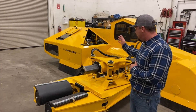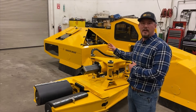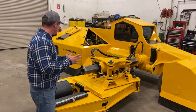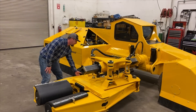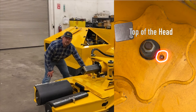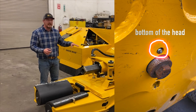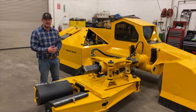One other thing that doesn't get talked about enough — right now we are the only shaking company in the industry that has external greasable bearings. What that means for you is easy serviceability and quick access. Normally you've got to pull a back plate off to get in there and grease the bearings. Now, right on the top of the head, you can grease the top and the bottom of the head and push grease completely through those bearings and you're right back in the field. Less likely that you're going to miss those serviceable items — one more thing we've done to increase serviceability and durability.